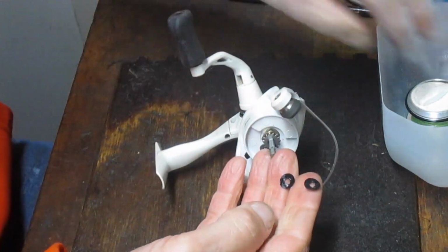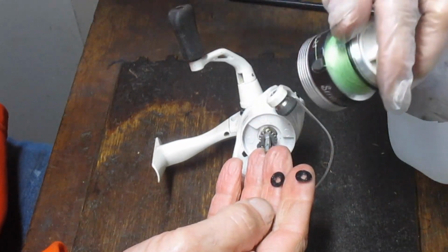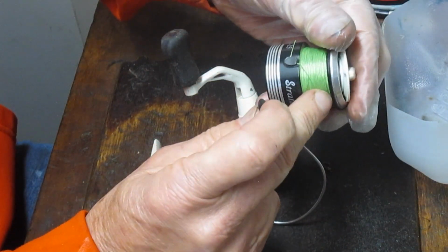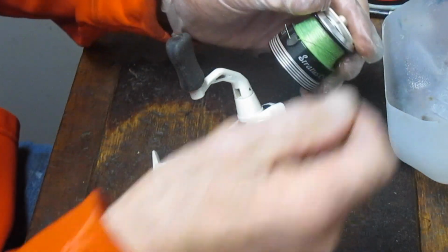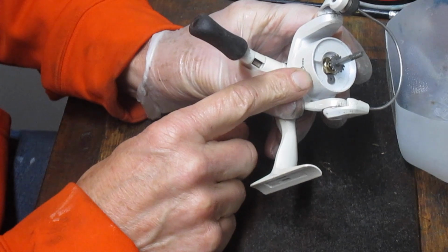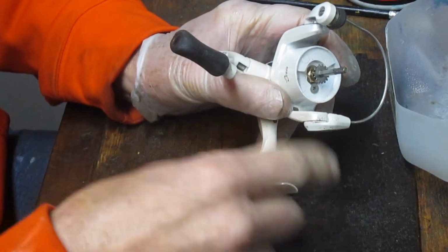When it bunches to the bottom, what it means is that the spool is going up too high and it's gathering more on the bottom, and that the stroke below is not getting down there where the line can ride. So we have 2. I'm going to make an adjustment when we go to reinstall, just putting 1 back in. That will lower the height of the spool on here. That'll have more line gathered to the top of the spool, and it should even it out.